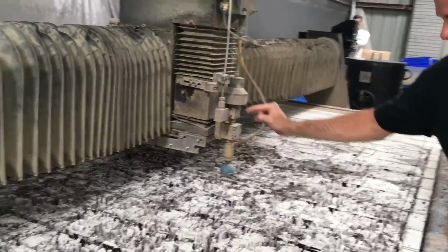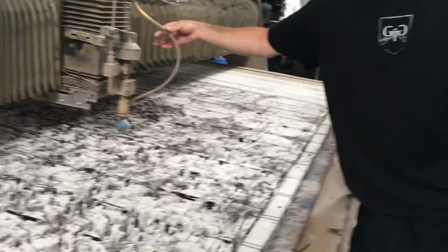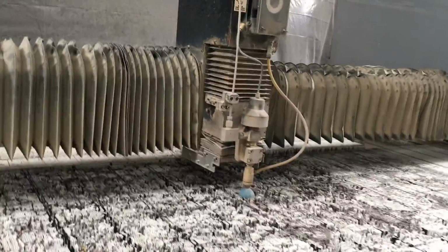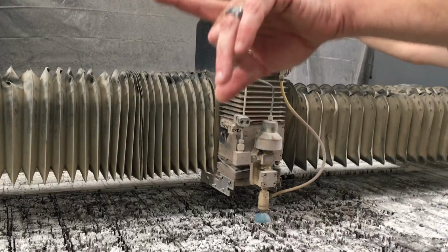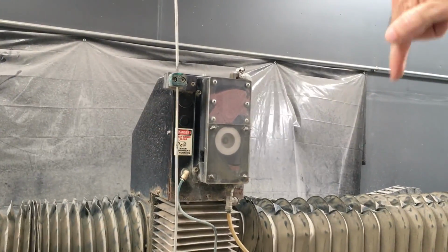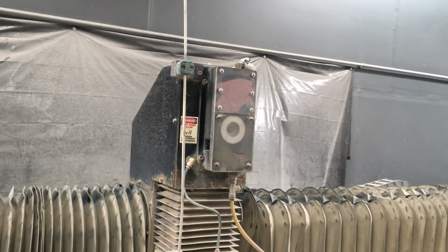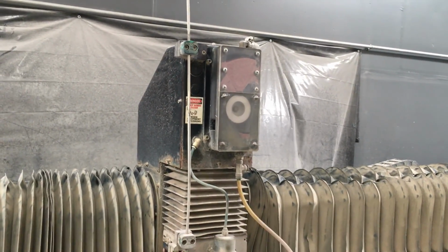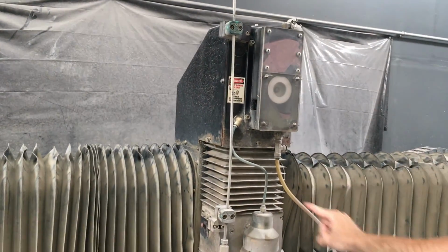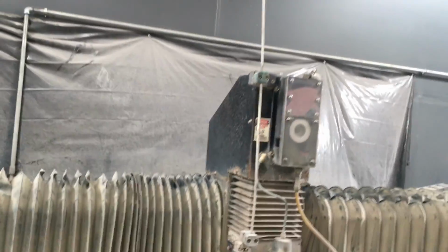The plunger goes up, now the water can pass through. Water shoots out, and it picks up the abrasive if there's any being loaded. Correct, because this is always pressurized as well. That's what that is. I saw that and I wasn't sure. So when it says go ahead and cut, it tells it to turn the water on a split second before turning this wheel, which allows your garnet down your line and mixes with the water. And that's how it conducts the pierce.